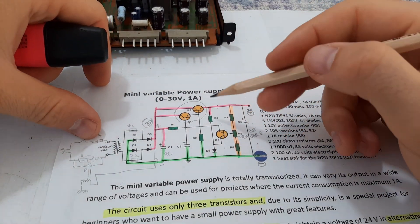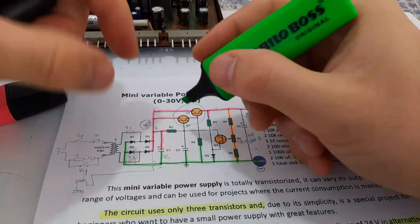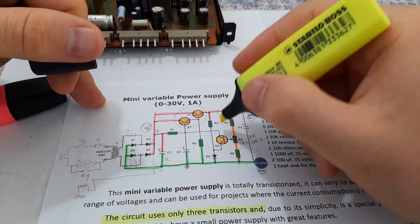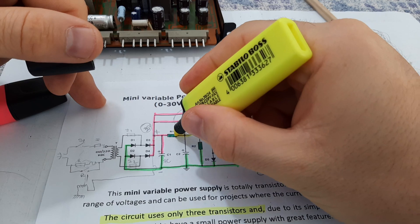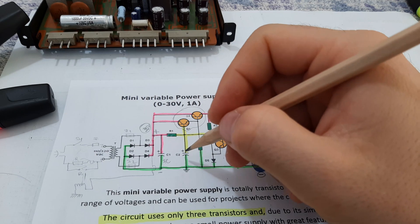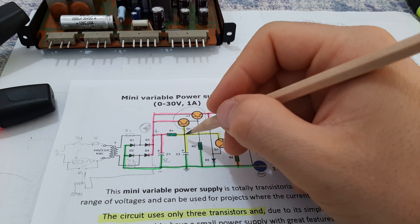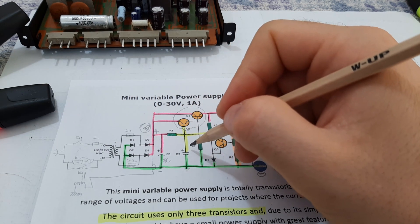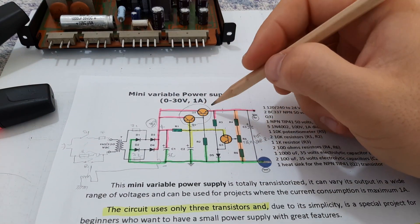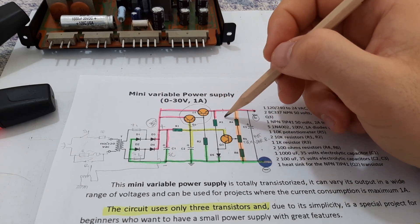This is doing the bias of transistor Q3. Also here you'll have capacitor C2, which is the stabilization capacitor for the base of Q1 — taking care of smoothing and stabilization of the base of Q1 for better performance. After that the signal is going on the base of Q2 and you will have the output from transistor Q2.